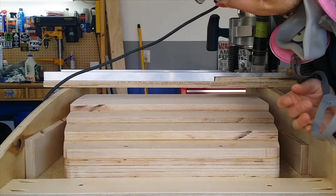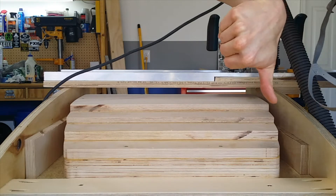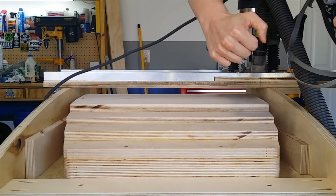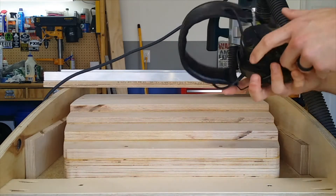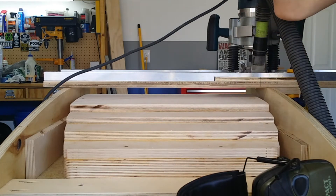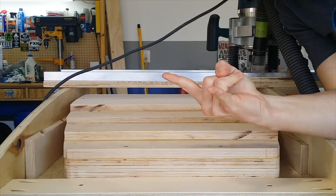The way this works, since my cutter is constantly turning in this direction, I'm only going to be cutting as I pull the router back towards me so that I'm always doing conventional cutting — not doing a weird climb mill and having the router shoot down the board. Earplugs are in, eyeglasses on, mask on, and extra ear protection. Party on.